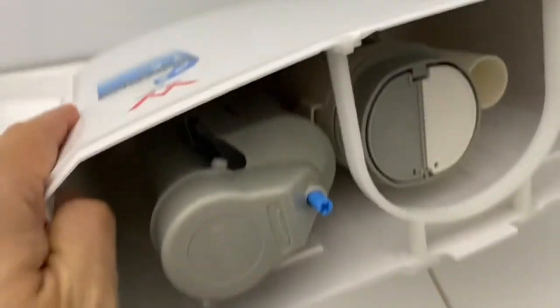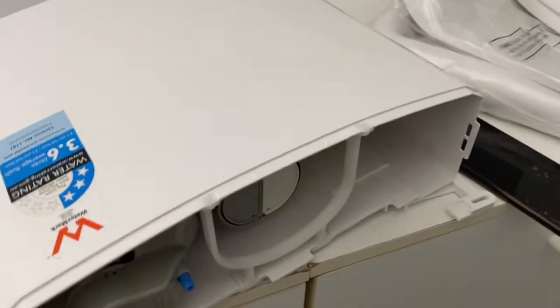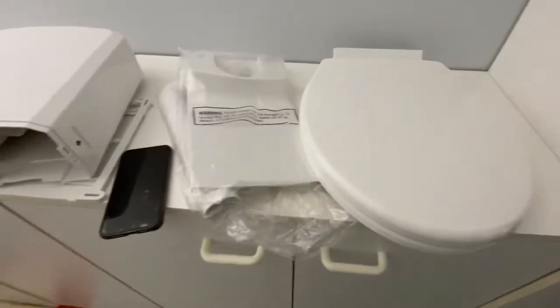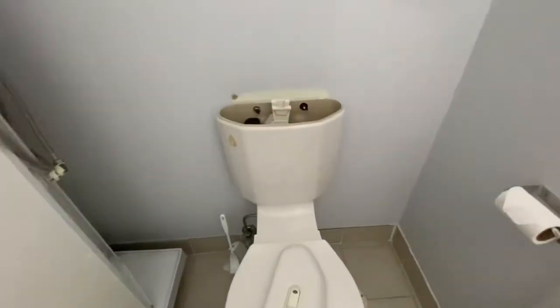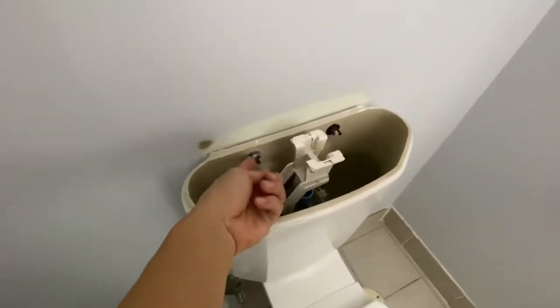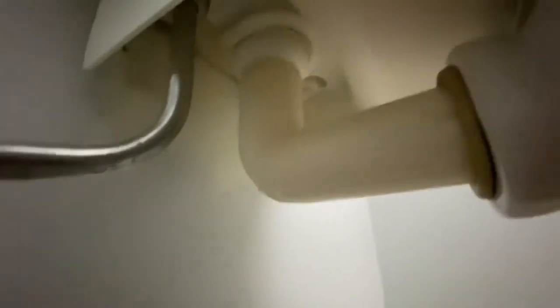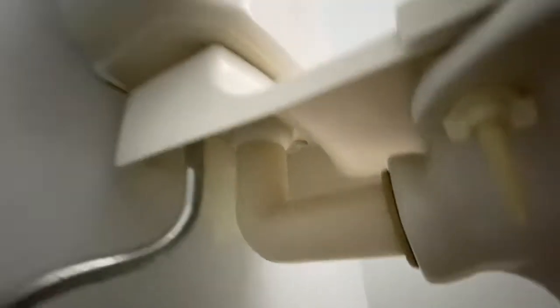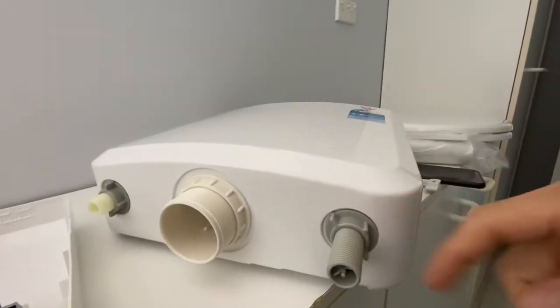I got it from a local hardware store. That's the front cover. It also comes with the toilet seats and some parts, so I'm going to show you how it all goes together. The first thing is that this old toilet system is mounted to the wall, so I'll need to put the new one on the wall as well. Behind here you can see there are two connections — you have to disconnect both of those, and they'll go onto the new one. The new one has a similar setup where the middle connection goes to the filling system.